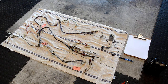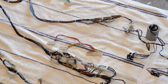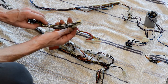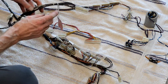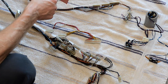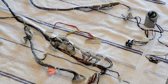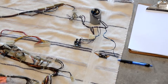On this particular game, the wiring harnesses are really dirty — this whole game was far dirtier than any other game I've brought home. All the whites are not white; they're a grayish color and the connectors are yellowed and quite dirty. To do this by hand, which is what I used to do, required clipping a lot of zip ties to separate the wires so you could get in with a bottle brush and toothbrush using Mean Green. It works pretty good, but not nearly as good as the dishwasher.